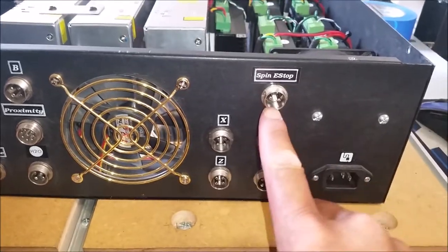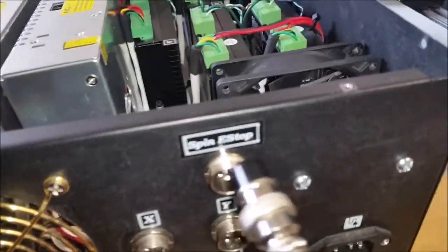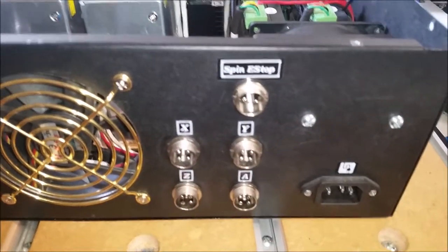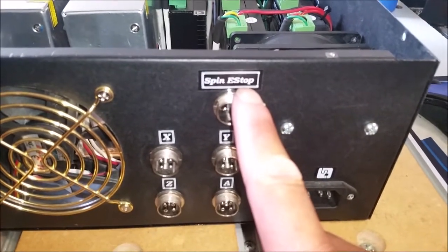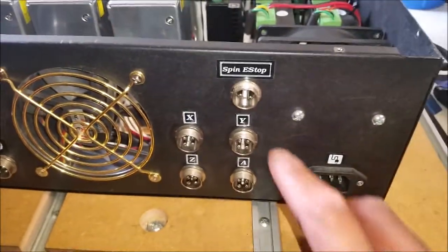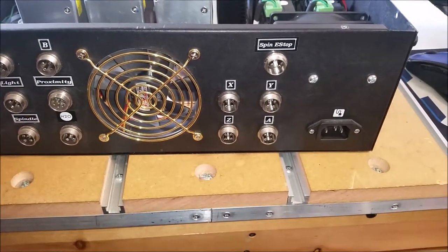On the back side, I added a two-pin aviation connector. This is the 120-volt out, which just plugs in, and this is the 120-volt coil to the contactor. So this has to be plugged in, or you cannot power the VFD up. The things you need are: a switch — you don't need the pilot light, that's just visual — an aviation two-pin connector, and the solid state relay. We'll go down and take a look at the contactor.